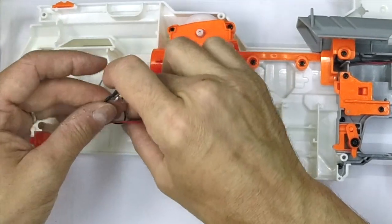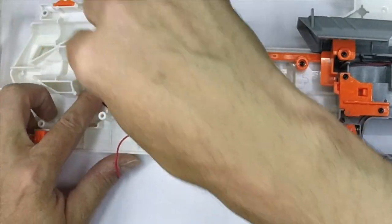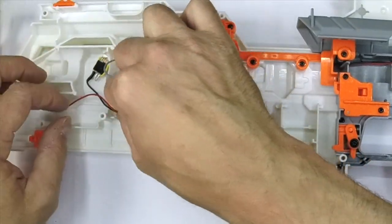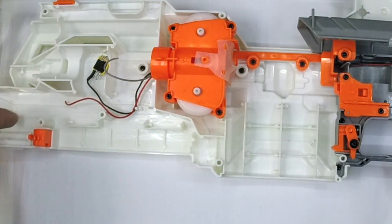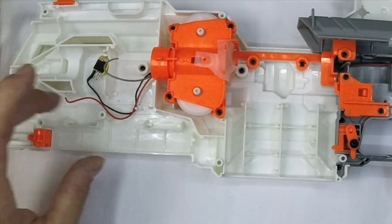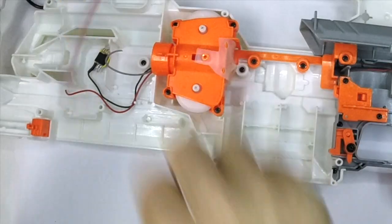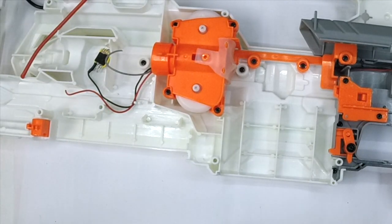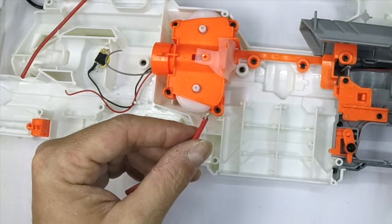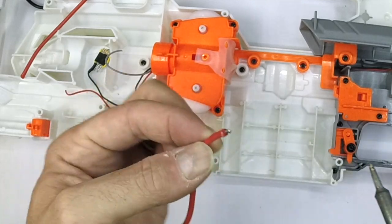It's all in, so that can now sit nicely under there. We can make use of the wiring clamps and I'll probably put a clamp in here to hold it all in place. This one I can now join to my main battery cable, which is probably going to sit up here because that gives room for the plug up in the front section — you need somewhere to push the plug in when you put the LiPo in. It's nice to have a hole for the plug. This piece is extremely simple: it just goes to the XT60 to hold the battery and the other end goes on to the Dean's. I'm tinning the wire — put a little bit of flux on, then put some solder on until the wire is a nice silver like that, ready to go on to the contact.